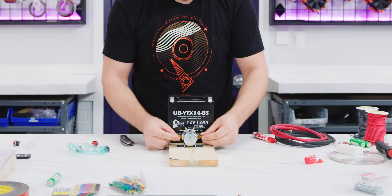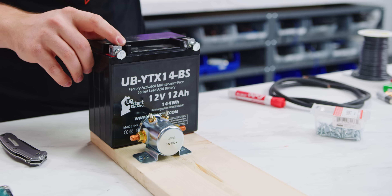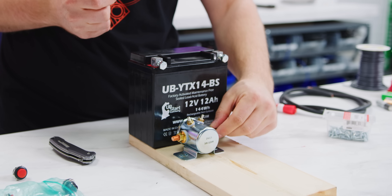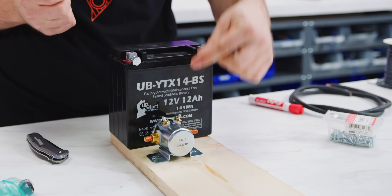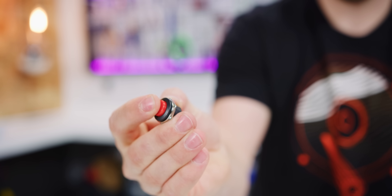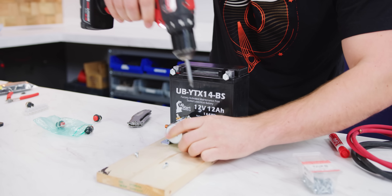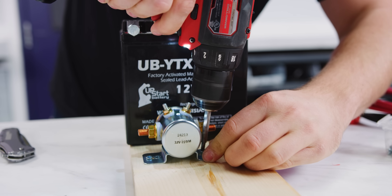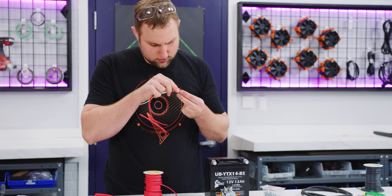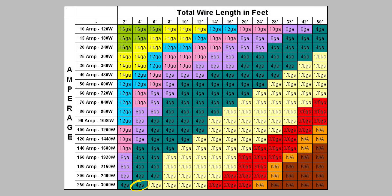So we want to bring hot down to here and then hot out to our little contraption and then negative back in. If we were to try to use a little toggle switch, for example, a huge amount of current would flow through the switch, letting the factory-installed blue smoke out and creating a nasty electrocution hazard. Instead, we'll let the big relay do the heavy lifting and use this smaller momentary switch to briefly pulse the power on and then release it. With the relay and battery mounted, it's time to sort out the wiring and the electrodes that will actually deliver the current to the nickel strips. We're using big four-gauge cables that you can find at any automotive shop. Four-gauge wire is capable of carrying 250 amps over a four-foot distance, meaning we are well within our safe range here.